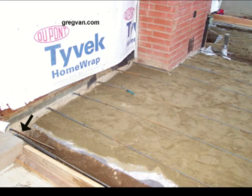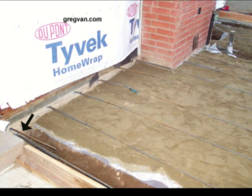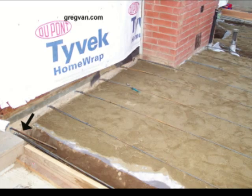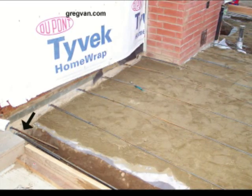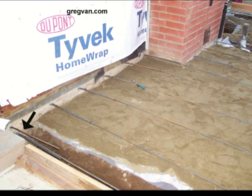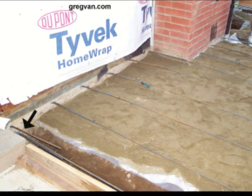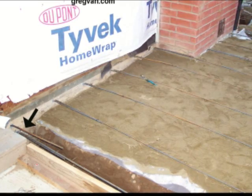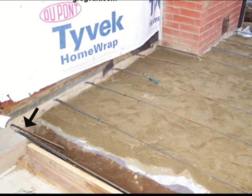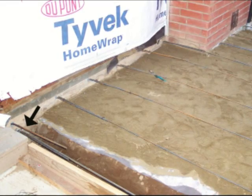While we were drilling our holes for the epoxy and the rebar to provide the structural support and reinforcement for the new room addition, we hit an air pocket. And I don't know how big this air pocket actually is. I got about 4 inches into the footing, and this is the corner of the footing. We shouldn't have had a problem like this, and it went in all the way. This is not a good sign here.